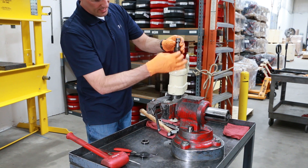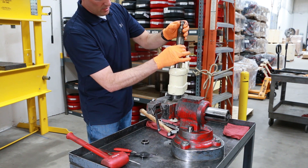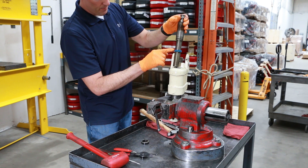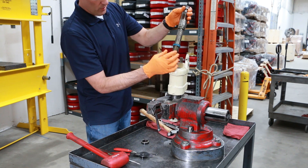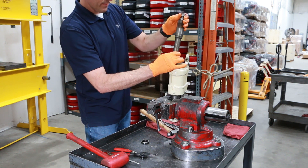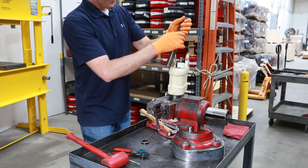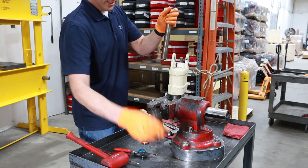This is a good way to see right underneath the bushing. You have your packing — your U-cup there — with the wide side facing down toward the pressure. You always want to have them facing that direction. We'll reuse this bushing as it's in good shape.